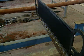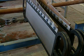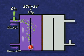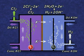These are the layers of anodes and cathodes that are held close together to produce the cell. This is a polymer-based membrane that keeps the reactants apart. Concentrated potassium chloride enters the anode compartment where chloride ions are discharged as chlorine. This leaves less concentrated potassium chloride, which carries the chlorine out of the cell. Dilute potassium hydroxide enters the cathode compartment, where water is decomposed into hydrogen gas and hydroxide ions. The membrane allows potassium ions to flow through from the anode compartment, and along with the hydroxide ions, these increase the concentration of the potassium hydroxide.